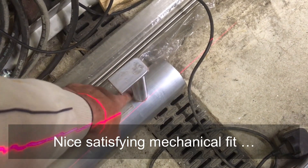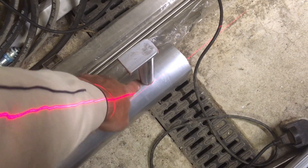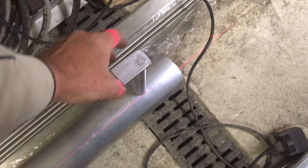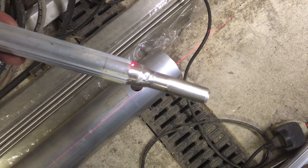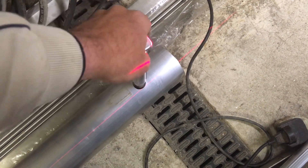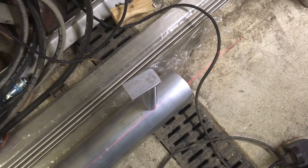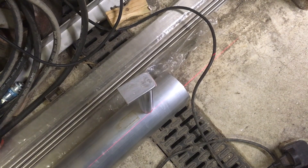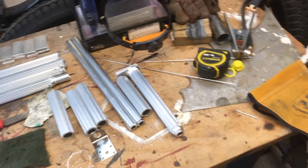I'll weld around there on both sides and it's done. There won't be too much heat-affected zone weakening the aluminium because it really is just a sealing weld — both pieces slot into the holes and the weld is literally just to seal it up and keep it in place. So I'll put in as minimal heat as I can get away with while still getting the weld wetted properly, and then that'll be good. This is my little step-making production factory.